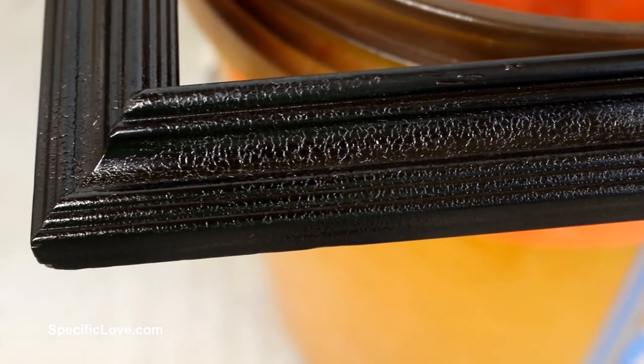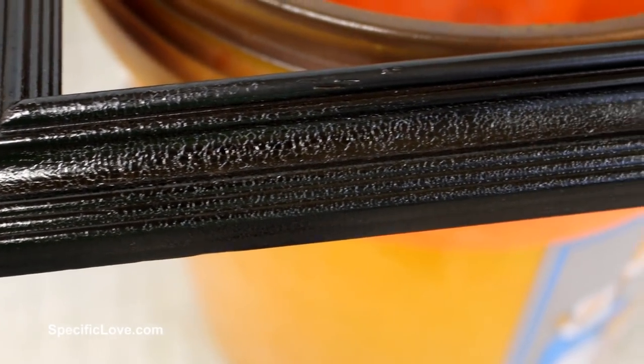After the initial coat of brown on the frame, we discovered that it didn't really match with the weathered gray on the box, so we decided to go back and paint it black. I put a few coats of black on there and discovered it had a real bad orange peel throughout, especially in the lower portions. So I went back and sanded several more times. After a few more coats of black, it still had a very faint orange peel look, but it gave it more of an antique look, which I'm very happy to go with.